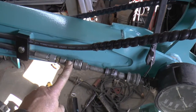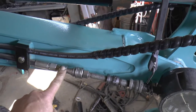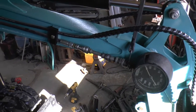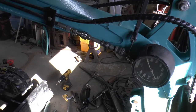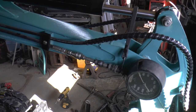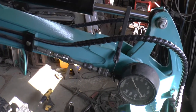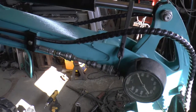I've got some quarter-inch quick connectors, and I need an adapter to go from this DIN to quarter-inch. I went to three different hydraulic places that are local here, and of course nobody knew what I wanted — everything is JIC around here. I looked online and found one place that had the adapter, and they wanted $25 for this little piece to go from the DIN to the pipe thread. I thought there's no way I'm paying that much, because I need two of them. Besides that, you guys know me — I'm cheap.